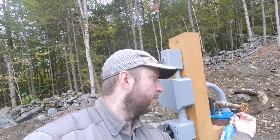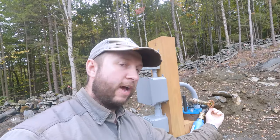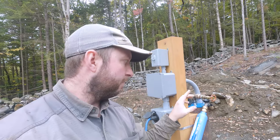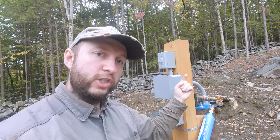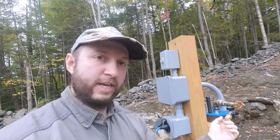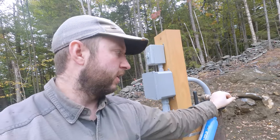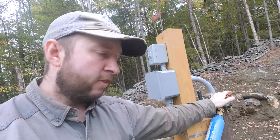To turn it off, I'm going to firstly close the valve on the hose there, then turn the well pump off. Last, I'm going to open this valve over here, and what that'll do is allow any water in the drop pipe to actually drain out through the drain valve that we installed. Air is being pulled in through here — if you put your finger on the end you can feel the vacuum as the air is pulled back through. That has now drained all the water out, so I can close that valve and then close the faucet up here as well. The well pump is off — I can now get the hose and power cord unplugged and put back away. That is the process to fill the RV tank.